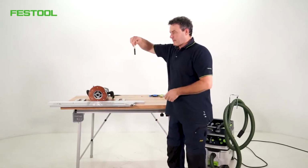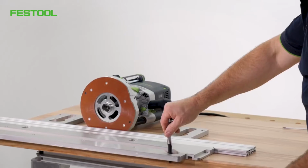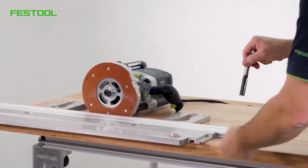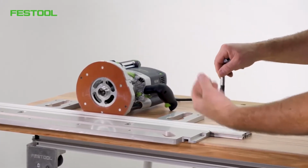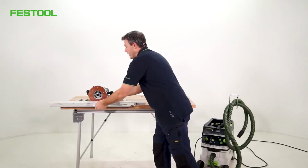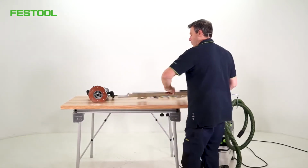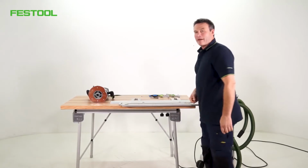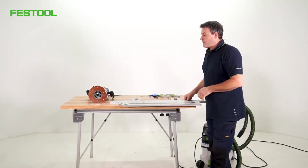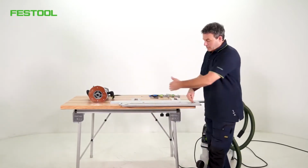When the cutter rotates clockwise, you can see that it now pulls out material from the edge. Of course, this is a big mistake. In this case, it is imperative to rotate the whole worktop and then work it from this side. That is the only thing I have to be careful of in this case. This means that there won't be any damage to this joint when I put it together with the counterpart.